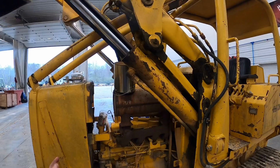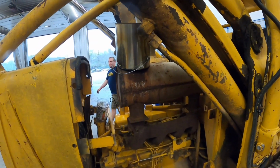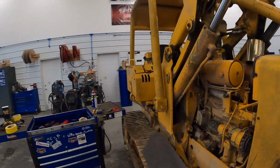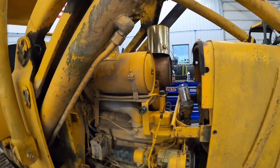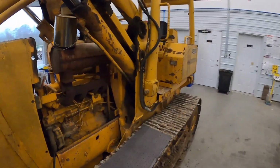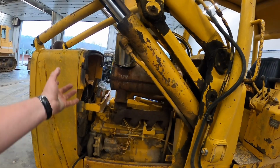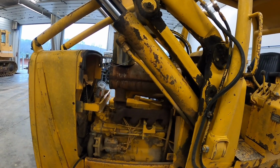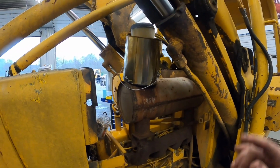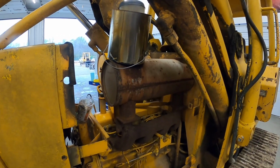I think you guys remember I said this engine's locked up. We're hoping it's just got some water in the exhaust, but as easy as this thing is to work on, me and Kevin just decided that we may just yank the head off and go right down to the problem, hopefully, and see what's going on, instead of messing through some little injector holes. It doesn't take an extra 30 minutes to get the head popped off this thing. So being we've got it this far, we'll yank his stuff off and get the head off of it and see what's going on. I'll take the exhaust manifold off first, and I think Kevin's gonna work on that side to get the air cleaner and stuff off. We'll pop the valve cover off and see what's going on under there.